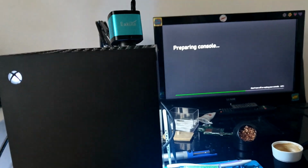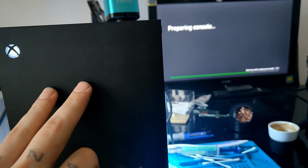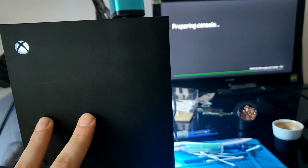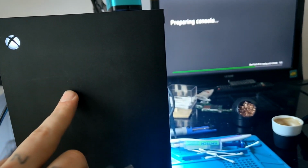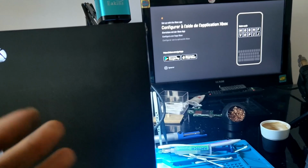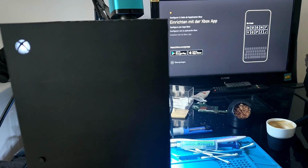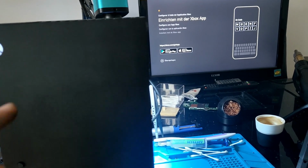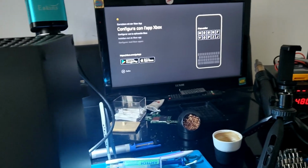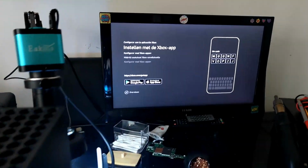So, you're not going to believe this, but I ordered a retimer chip ready to replace it, and I thought I'd just take off the current one. And I thought I'd just put it back on for the meantime because I put leaded solder on, so it's easier for me to take off next time because it did take a while to get off. And it still wouldn't work. So then I tried safe mode, and safe mode came up. I was like, what? And then yeah, so I just hit continue, and yeah, it's done. It works. What? Do the wiggle test. Yep, port's nice and wiggly, not wiggly, but it's fixed.